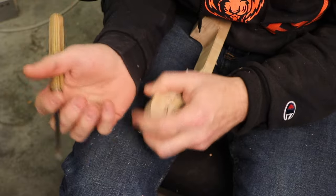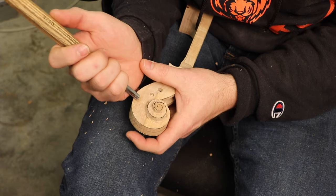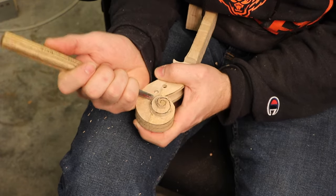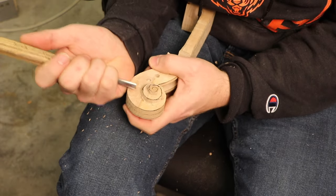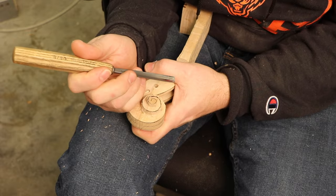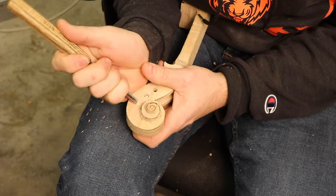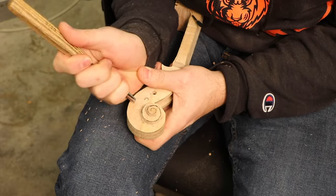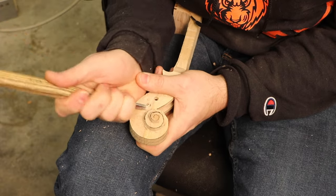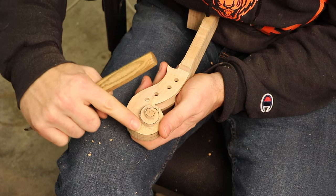Basically the clamp gave away that I was holding onto and slipped. But if you ever see me carving like this, you'll see me do two things. One, the amount of the chisel that's sticking out — when I hit my palm it's hitting this, and that keeps everything from going into my hand. If I was up here carving, that would be very dangerous. So carving very controlled, taking lots of little slices, little bitty bits.